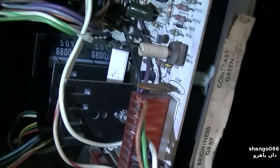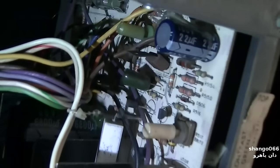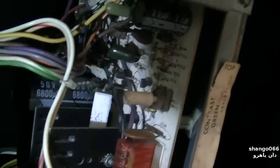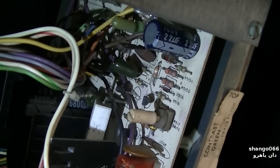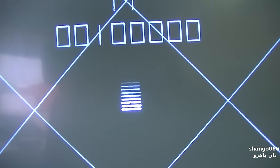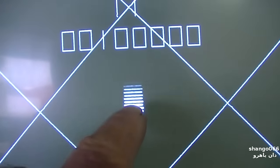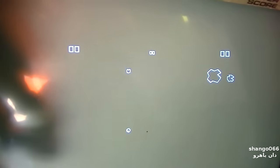I guess that wouldn't have much to do with the spot killer. The spot killer is right here. One thing I forgot to add: you've got a brightness and contrast pot right there - that's your brightness - and the green one back there is your contrast. What you do is you put it in test mode and you adjust the little grayscale bar in the middle. You don't want it so bright that you get those trace lines - you put it in test mode and adjust your grayscale right here.